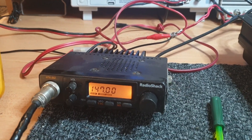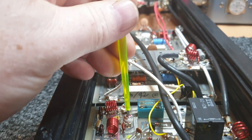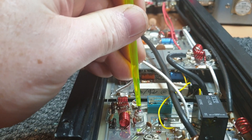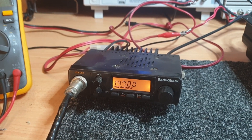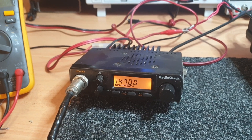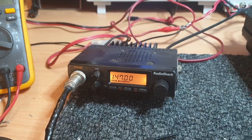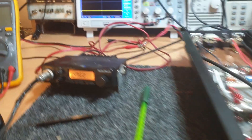That's the sort of gain we want to see. What I'm doing is just peaking the input — it'll normally be this little fella here. You can see how fine the adjustment is. This was not very far out of alignment, but if it's out, it'll look like the FET is attenuating. Once peaked, we can throw the switch and drop back with no preamp — and look at that — the preamp is working quite well.